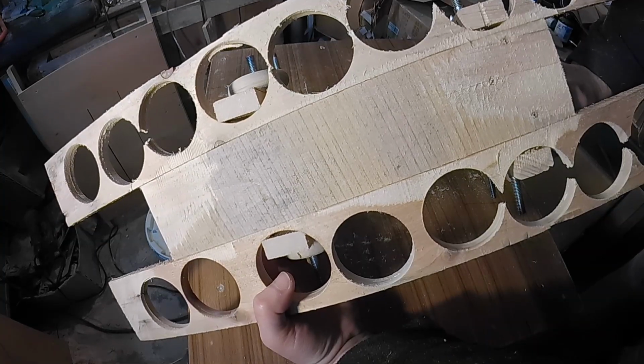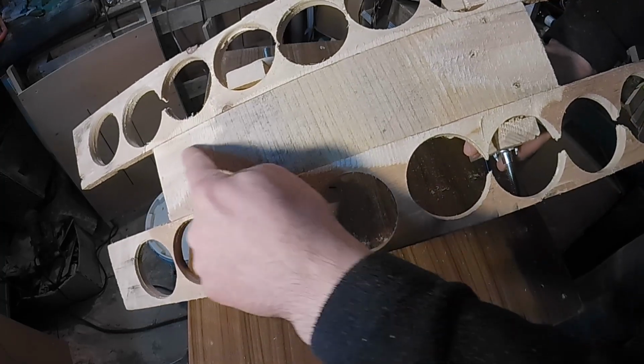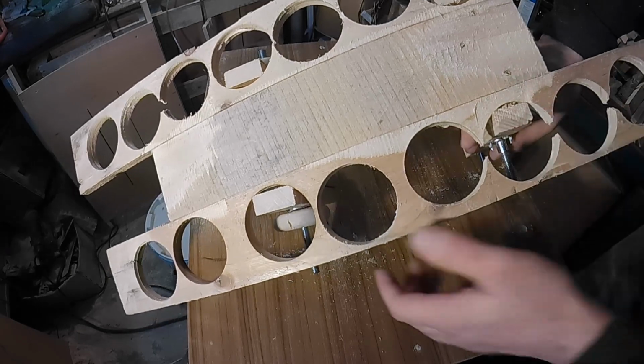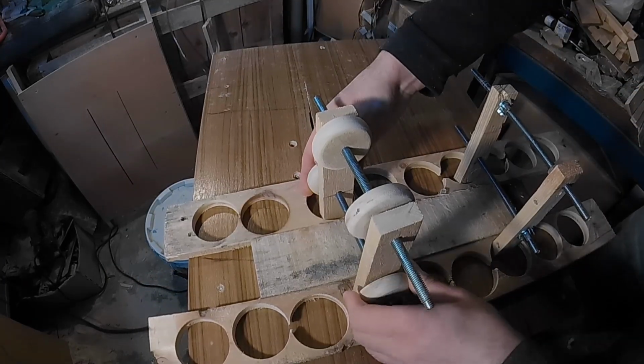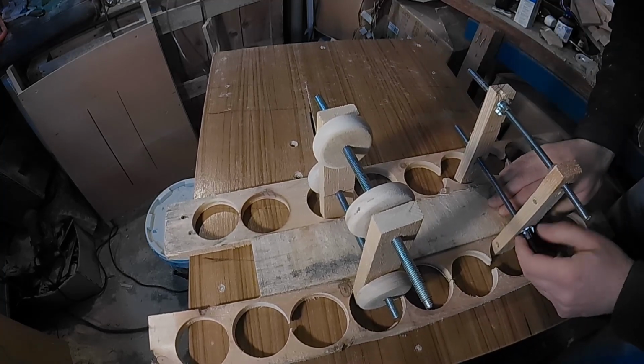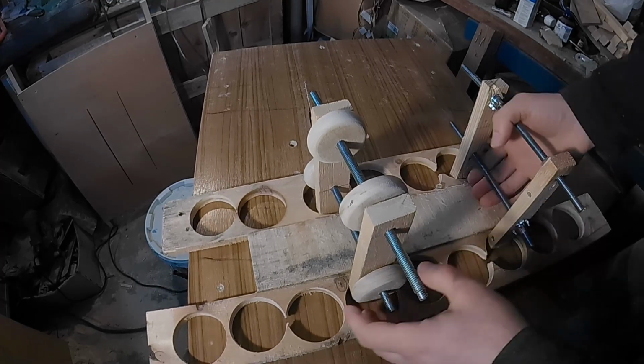See how the blade removes material from some places. Depending on the board, you may need to pass several times. Don't lift the blade, instead release the clamps and press the board down. Then tighten them again and make a second pass.